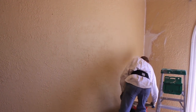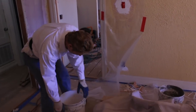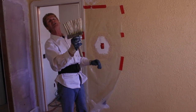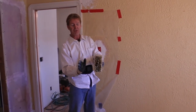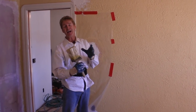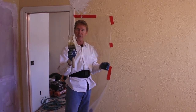Now I'm going to show you guys the dash. This is a dash brush — there are about ten different types of dash brushes. I have some that are square like this, with eight-inch bristles, four-inch bristles, six-inch. I've even dashed using whisk brooms. You put three together because I've seen particular textures and thought I could match that.